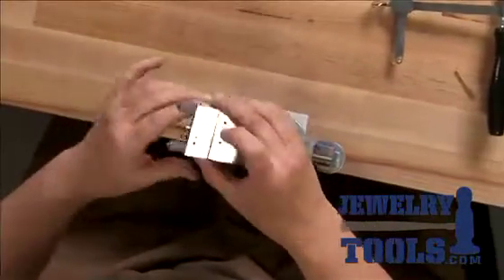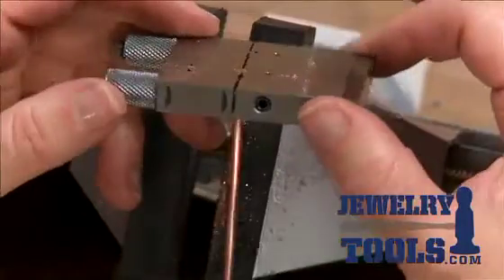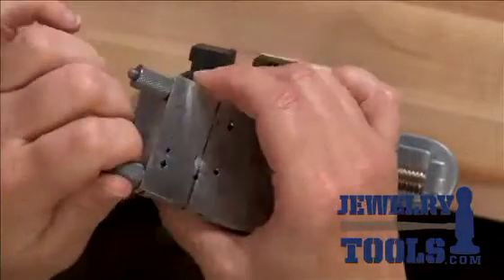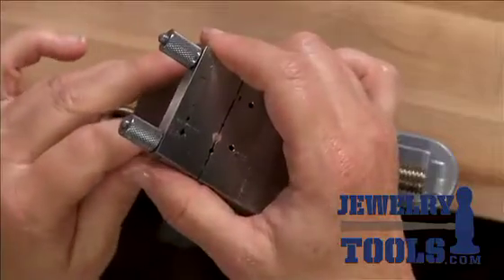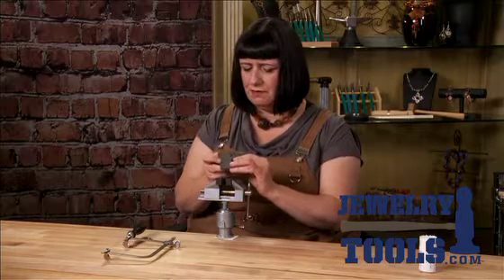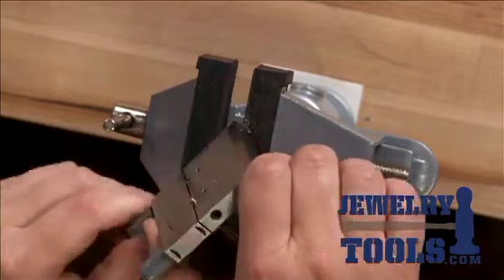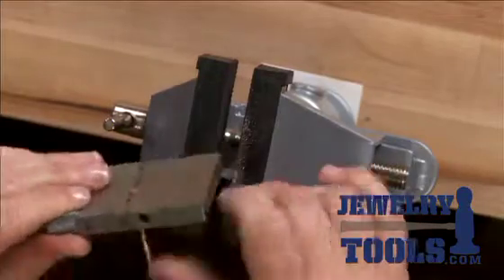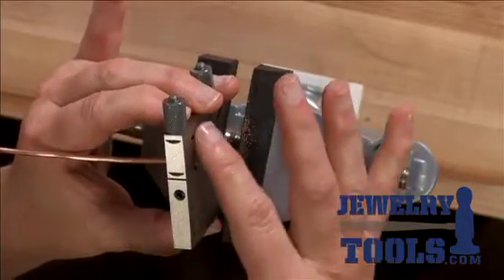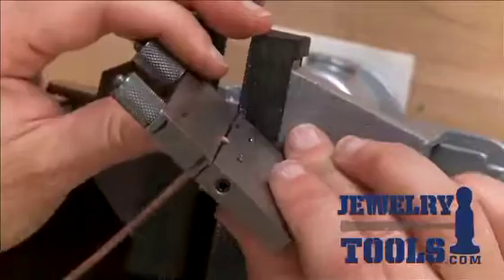If you really need a super even and flush end — you can see how nice and flush that is — it's also really great for holding your wire if you need to file the end flush. I would open up my vise just a little bit, expose a little bit of the end of that wire, not very much, and go ahead and tighten the vise down just like so. Now for filing, I could just get my file and keep filing until my file is flush with the face of the vise, and that also gives me a nice flush end that's suitable for soldering.